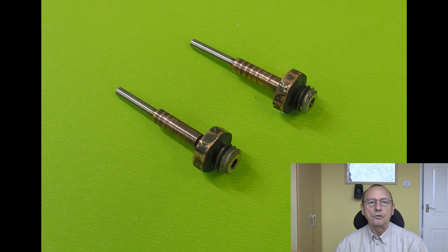static filament, which is what happens with a mixing hot end, where not all the inputs are moving forward. But with this one, the intention is that all the filaments will move all the time, albeit at half speed. So in that case, in my opinion, these are the best heat breaks that money can buy. Now, with the bimetallic design, the walls of the heat break tubes are really, really thin, so very little heat finds its way past the heat break.